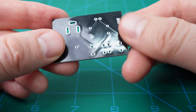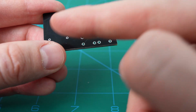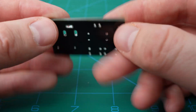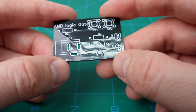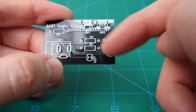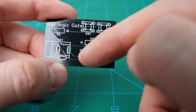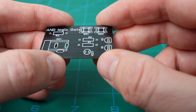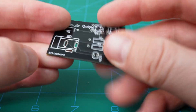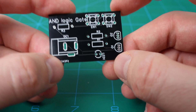On the inside you have just a thick layer of substrate — that's what gives the board its rigidity and lets you put components in there knowing they'll stay solid. This is actually a two-layer board, so the same layers are repeated on the back: a layer of copper with traces and another solder mask. I didn't add a silkscreen layer on the back since I didn't need any text there. The reason I used a two-layer PCB is because it allows you to route more complex wires across the board without them crossing. On a single layer you'd have to make sure no traces cross, otherwise they'd share current. Using the back side gives more freedom in design and makes the layout much more compact.